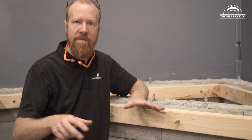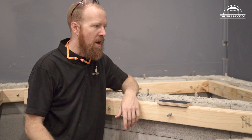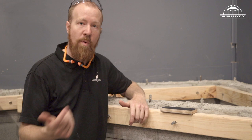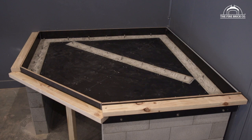For me this is a fairly complex shape and I have to cut my formwork to drop in and fill it. For the back it's a pretty simple triangle — I'll measure that up and cut it. For the front I'll measure it up roughly, cut it roughly, and then lay it on top and do markings in place to get the shape I want. Note that it doesn't have to be a single piece — you could put a divider down the middle with a backing strip underneath. Basically all you're trying to do is fill this void with plywood.